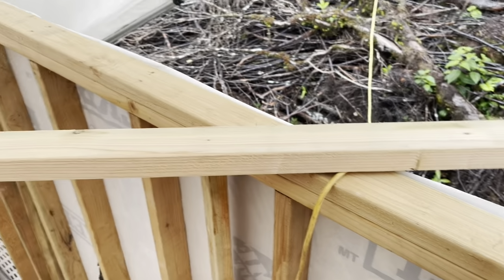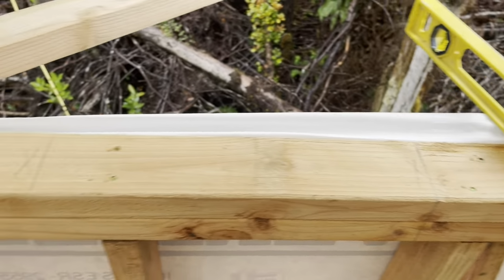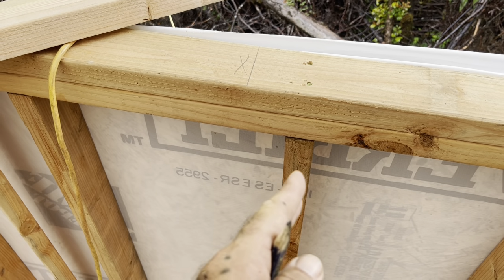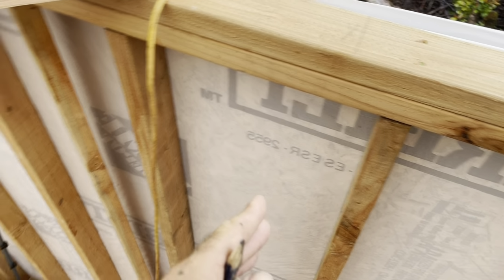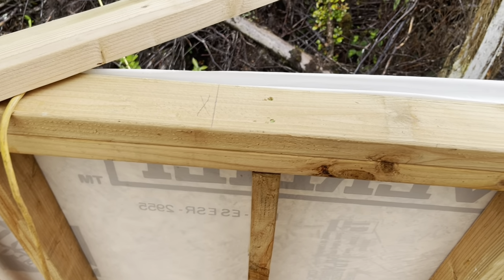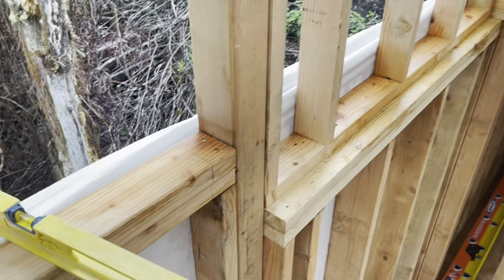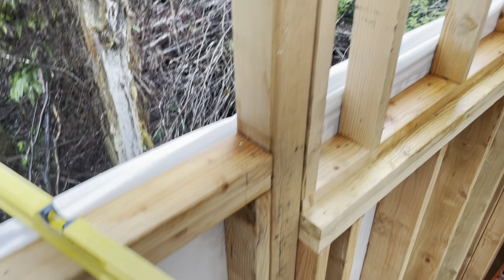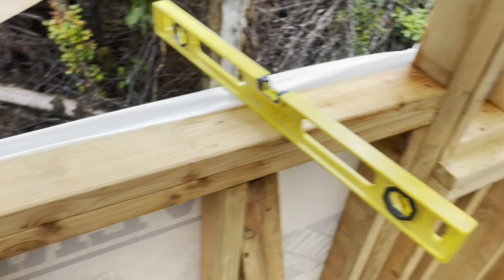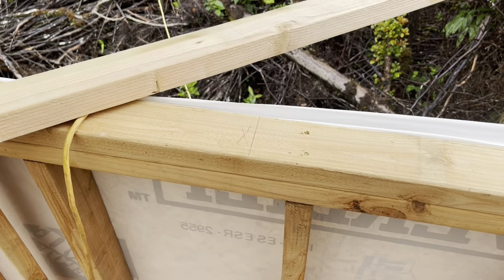All right, so I'm up at the top of this wall. And you can see I have my marks with the X's. That's where my beams are going to go. You can see how far I'm off. Remember I was talking before about how I had my 16-inch center off so that my sheets of plywood weren't matching up down here. You can see the distance it's off right there, which is 4x4. I figured out later that, although the siding matched up on the other side, because I didn't take this 4x4 into account, this side of the wall is what got messed up. So that side was still good. Anyway, I'm correcting it on this part, so when I put the next level of siding up, it'll all be correct.